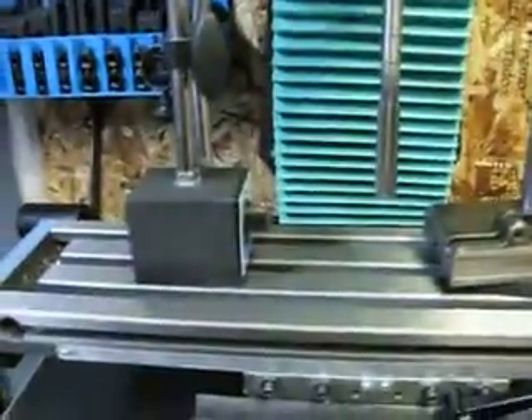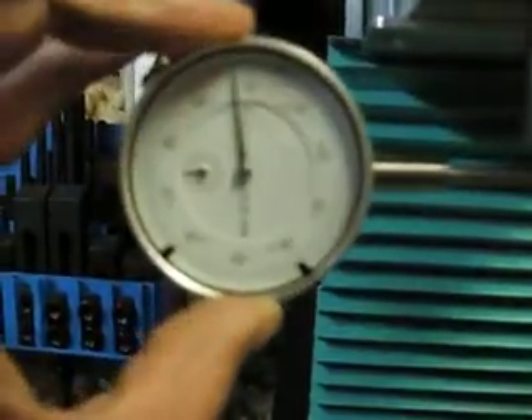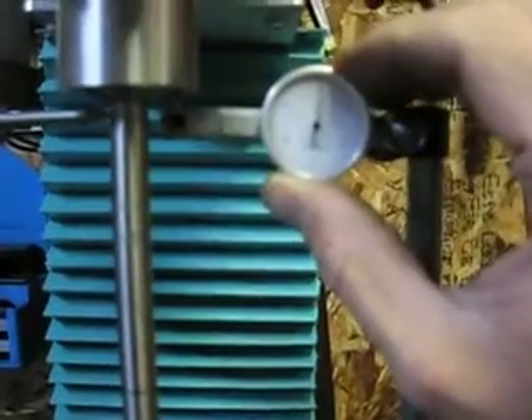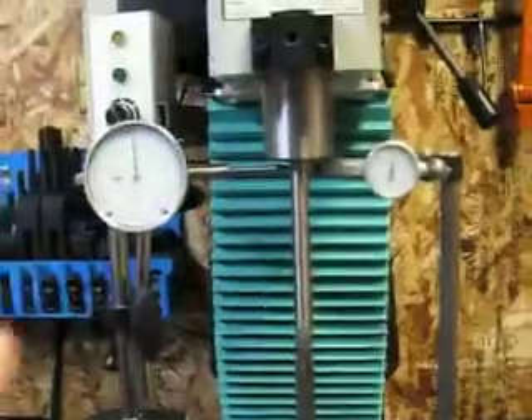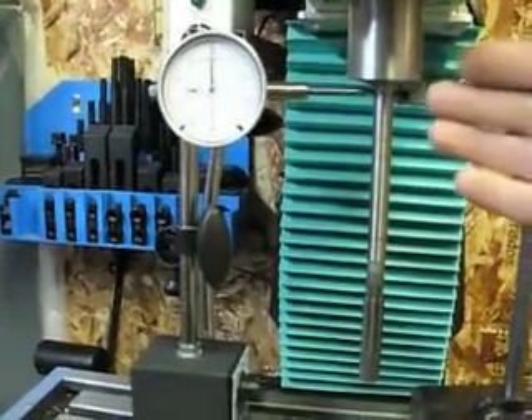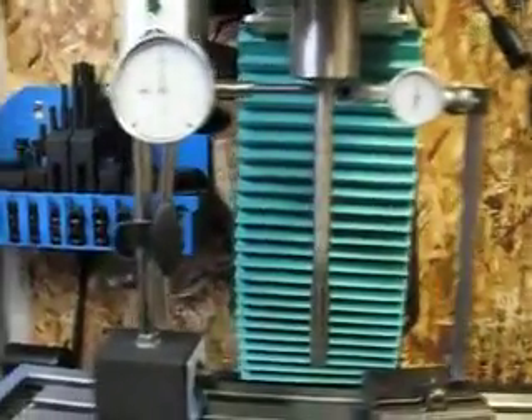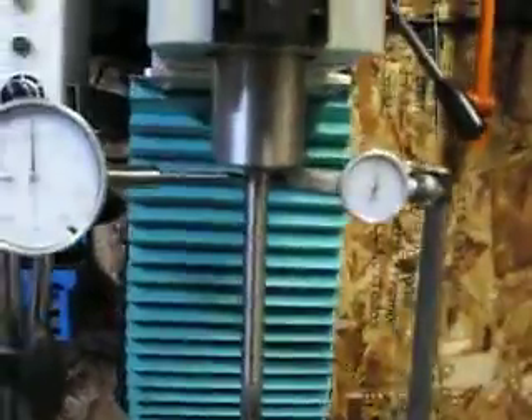Here's the basic setup. You've got the magnetic holder, and I put two gauges on here just so you can see. I am a little bit off zero, but I was just playing with it. As always when you're using these dial test indicators, you want to keep your indicator arm as parallel to your part as possible. Since I'm running it off the side, you want it like this with the part — it's called a cosine error, and you can actually get quite different readings if you don't have it as close to parallel to the part as possible.